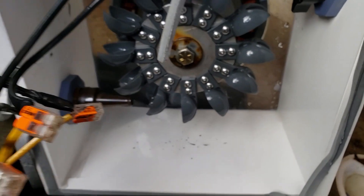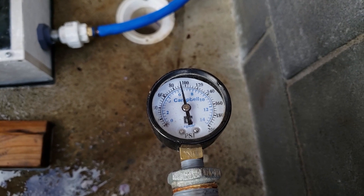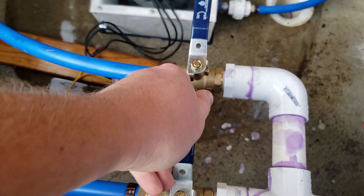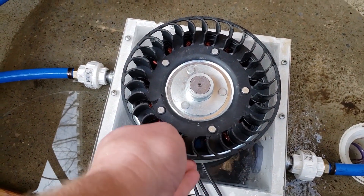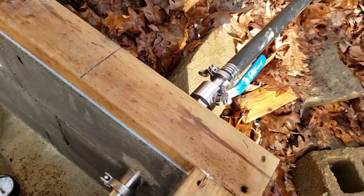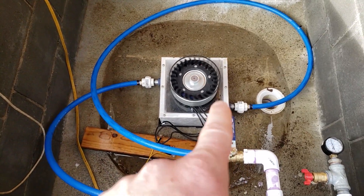I'm going to turn it on with just the brass nozzle. The pressure is going up as the bubbles come out — see it ticking up there a little bit at a time. I'm going to turn this on with a single nozzle and it needs a little kick because it doesn't have full pressure right now. We'll let that pressure build up as the penstock fills back up, since it was sucking air with air bubbles trapped in it. We're back in operation at limited capacity until I replace that jet with something else.